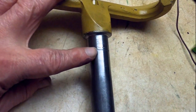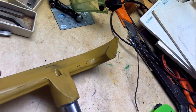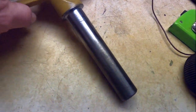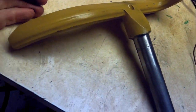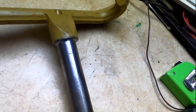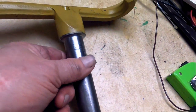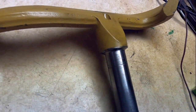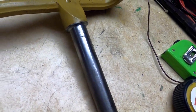I've finished it up. The tool post has been machined — you can see here. I've got it mic'd to the same dimension as the rest of it, so it should fit on the lathe when it's put in place. That completes this project. Hopefully if you have something like this in the future I've shown you at least one approach. I would advise you though — if you don't have experience doing things like this — you can get pretty severely injured putting something like this in a lathe and spinning it without some means of keeping your arm out of harm's way from this swinging hunk of cast iron. But it worked out well enough to put this into service on an 18-inch lathe.